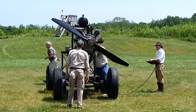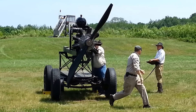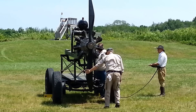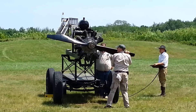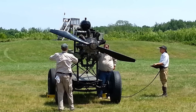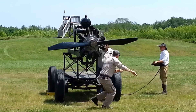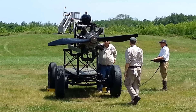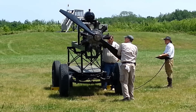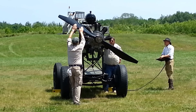Once the pilot has this airplane running and flying, the engine's operating at a constant speed. These rotary engines typically run somewhere around 1,100 or 1,200 RPM. In order to slow the airplane down to bring it in for landing, the pilot has to manipulate this electrical control, and he can cut it down to half speed, quarter speed, or eighth speed. It's all in the electrical — not the timing necessarily, but just the firing of the electricity and when the system is grounded out.